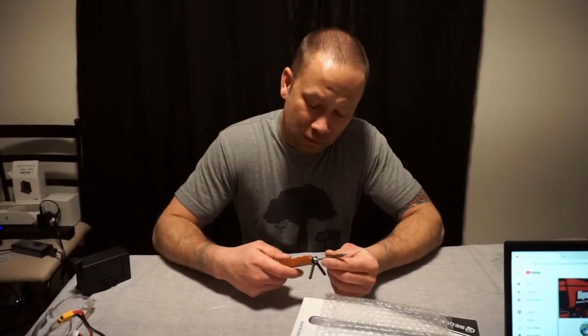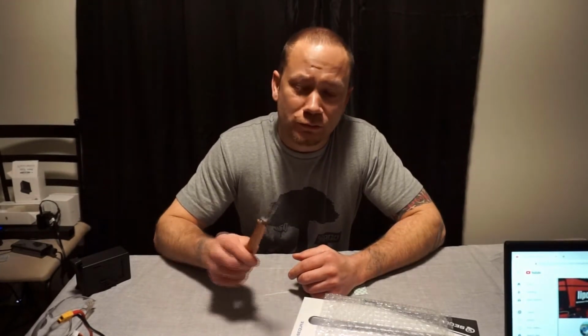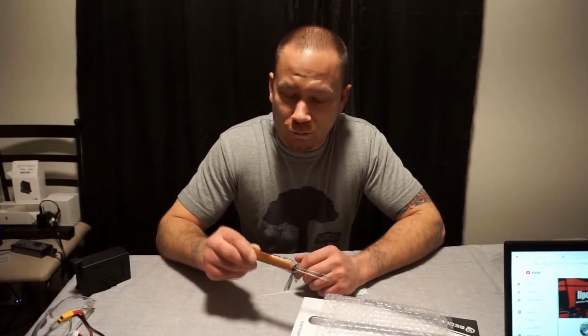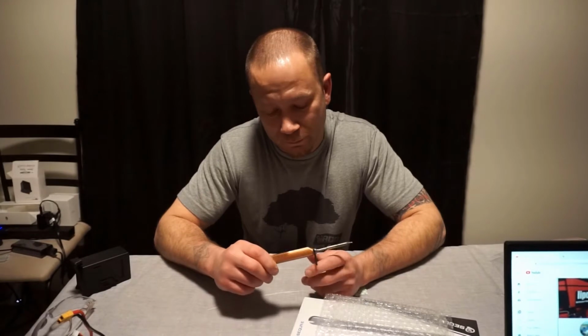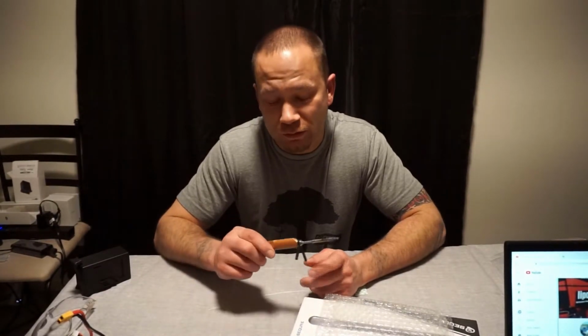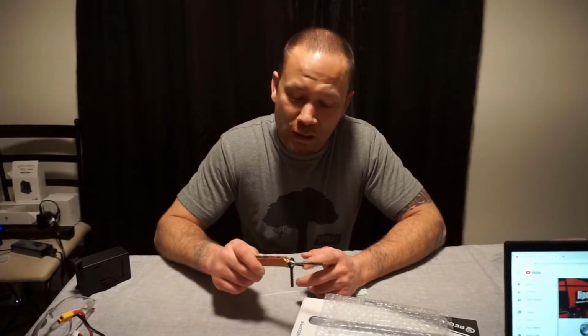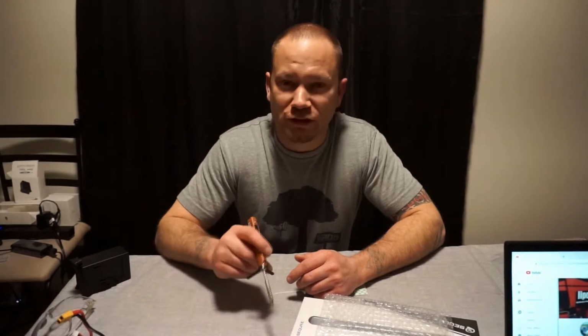actually screwing mine up. And I don't mean like I broke the tip or I cracked the case or I pulled the plug out sideways. I had what I thought was the updated firmware for the TS100, and it turned out that it was something else, even though it still went in. Now my TS100 soldering iron does not work the same way anymore. It heats up to 405, which the firmware update is supposed to update it to 450. It literally stays there, and even with the gyro moving, it just shuts itself off after 3 minutes.